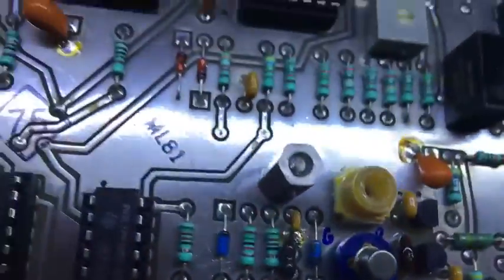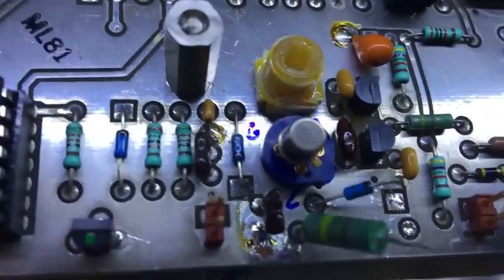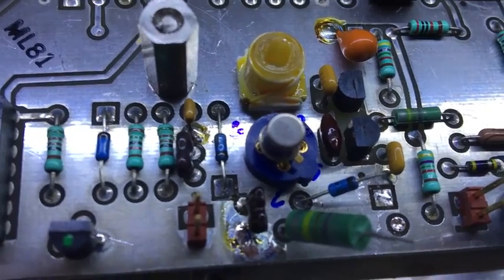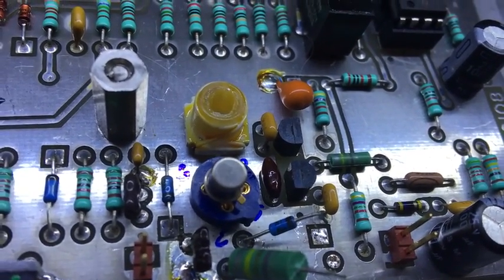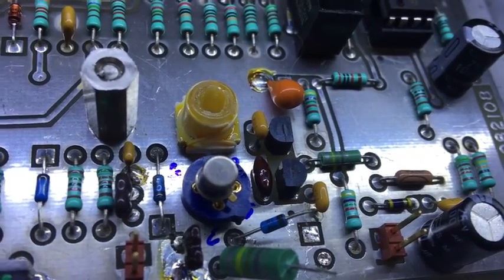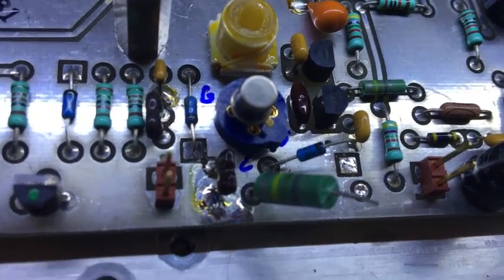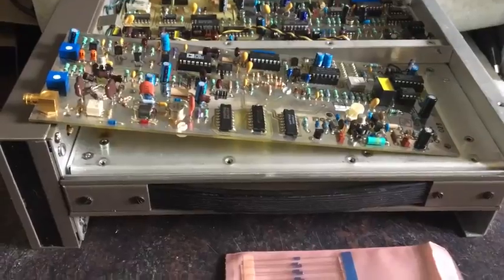What I found is on the other unit which I was just trying to troubleshoot, the oscillator wasn't working. I lifted that diode out just like I did in the first unit and that diode is not shorted but it's very low — about 0.03 volts in both directions. So that one is leaky and blown as well. The other two diodes checked out okay, so hopefully that's all that's wrong with that one.